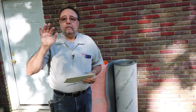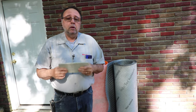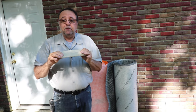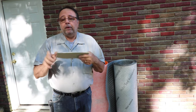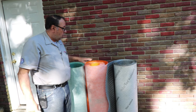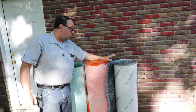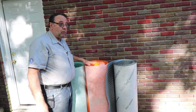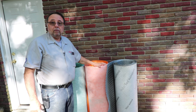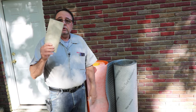I have a video about floor deflection and what it needs to be so you can install your tile floor — I'll link to that in the description. The underlayment is the product you put on top of your subfloor. We're talking about plywood subfloors here, although uncoupling membranes can also be installed on concrete floors. For a concrete floor, I would probably say you're better off using these than going directly over the concrete, but that's a discussion for another video.